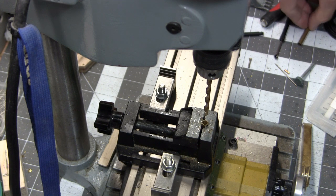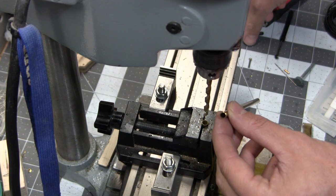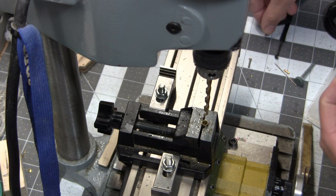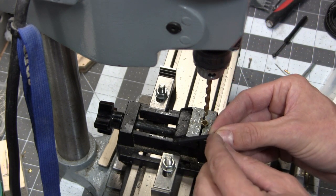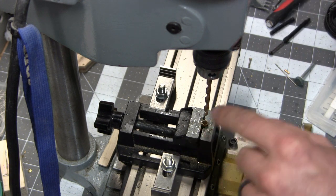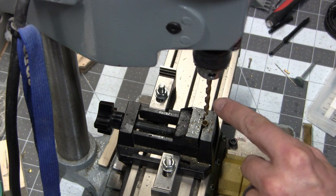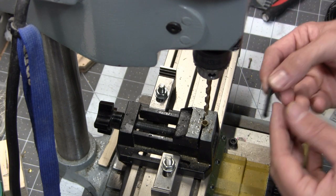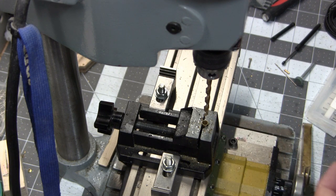I have a piece of 4-mil tubing here, and it's a thick wall of brass. It's a little too heavy-duty to look like a correct scale if I were to try to slide it over here, but the exterior is about 3.5 millimeters and the interior is 3 millimeters — so actually I think this is 3.5-mil tubing. I'm drilling the inside out with a drill bit that just so happens to be the same diameter as this cylinder.